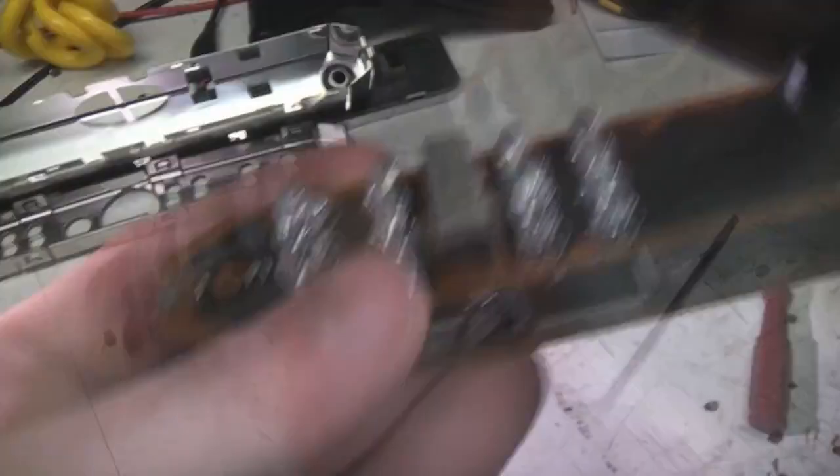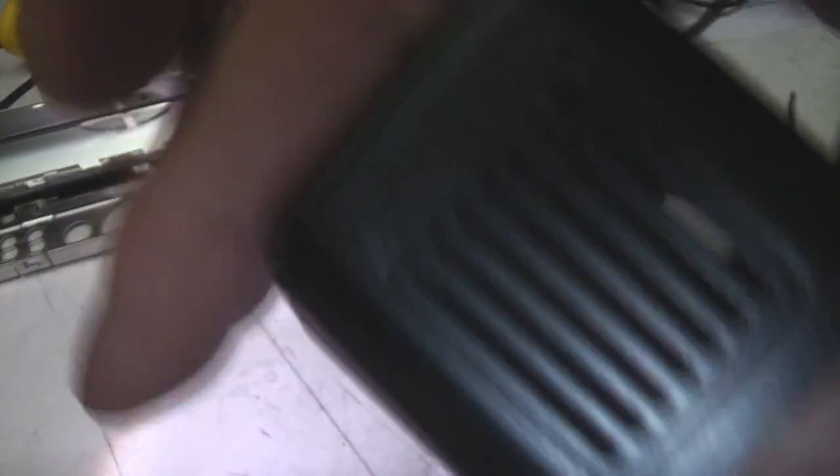So we've got a sandwich of two boards with a nice big gap all the way through for the air to get past for cooling — there are vents on both ends of the case so you get a nice clean airflow through the middle. If you run it without the fan this front board does get pretty warm pretty quickly.